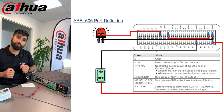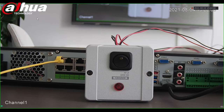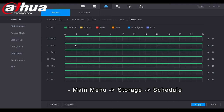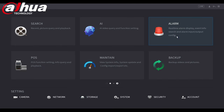Now I need to configure everything in my NVR to ensure the wiring worked as expected and that the NVR records based on alarm input. First, I go to the recording schedule by right-clicking and selecting Main Menu, then Storage. By default the NVR records constantly — I want to change that to alarm-only recording. I click All, delete the existing schedule, then choose Alarm and draw it in red to apply alarm-based recording across the schedule.